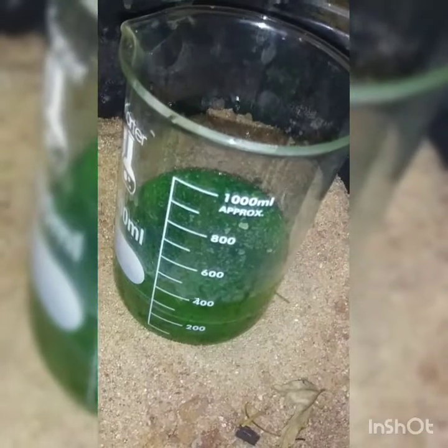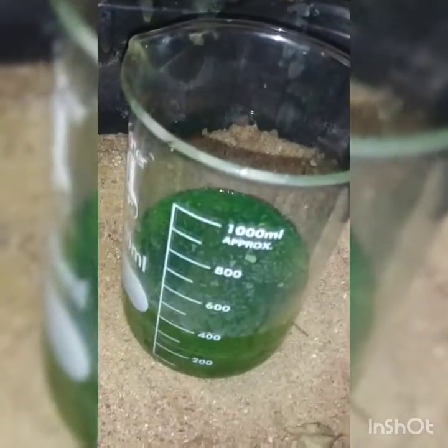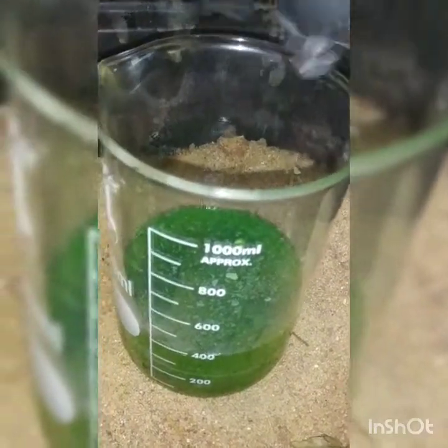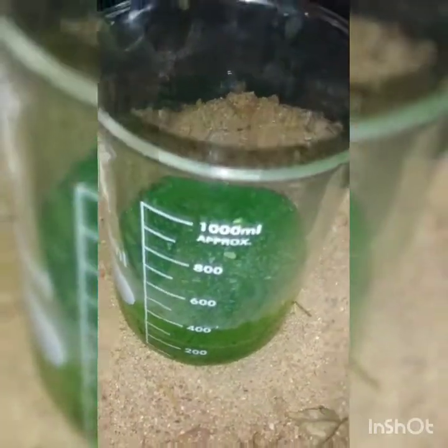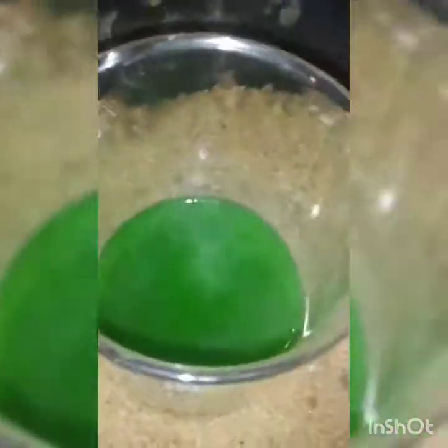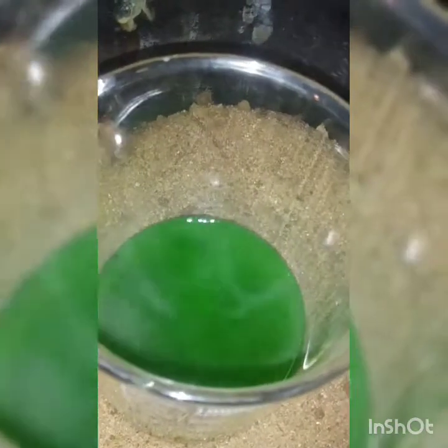No harm done. I have some sulfamic acid on hand. So let's go ahead and just denox this, even though I added this extra nitric. It's always good to do it while it's hot because that's when it works best. A little pinch. Oh, make a liar out of me. It might not even be quite hot enough yet, but it would have sizzled away. Let me go ahead and pause this, let it get warm so I don't kill too much time, and then I'll show you how it looks.